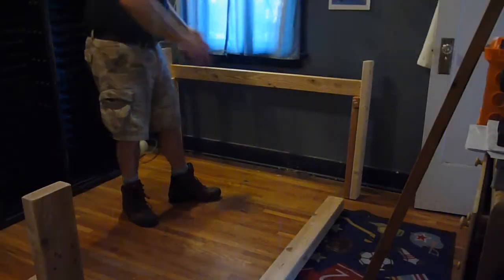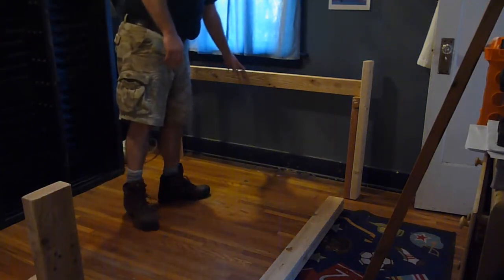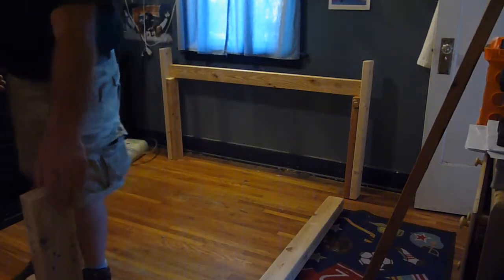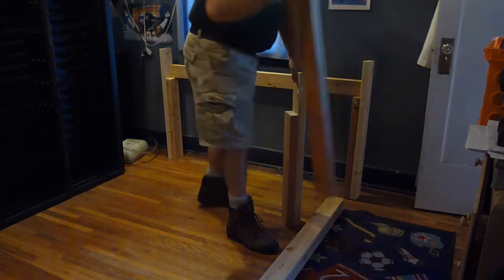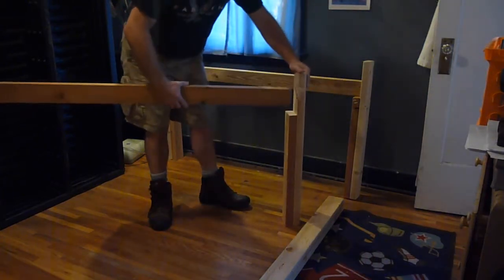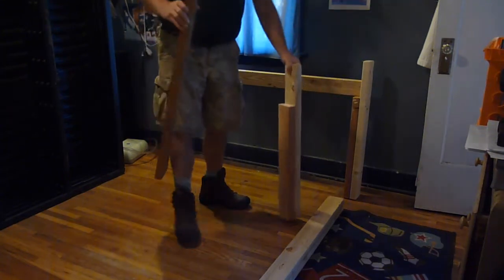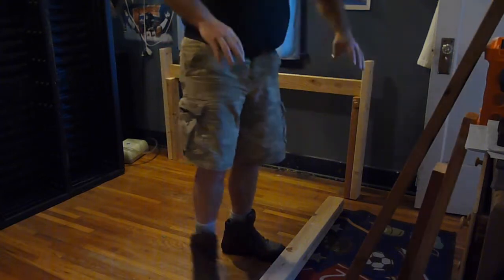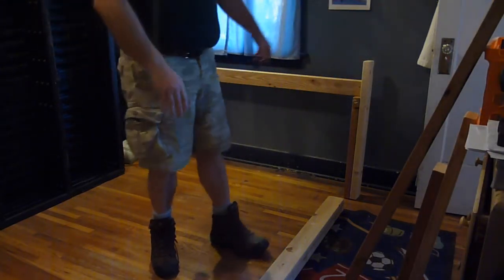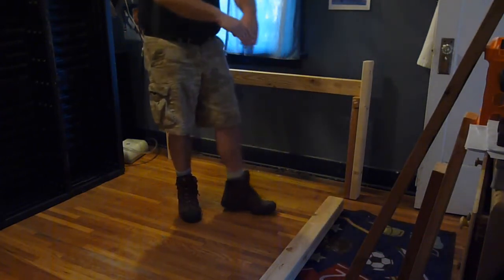Got all my pieces cut out and now we've got to drill them. For the headboard part, this is going to be up against the wall — I've already put this one together to give you an idea of what it'll look like. Basically you just have your legs on either side and the cross piece sits right on top of the 2x4 like that, with a couple of screws. I'm going to get both those done and put the side stretchers on the same way, going from the corner here to the corner on the back one.